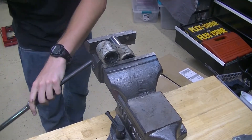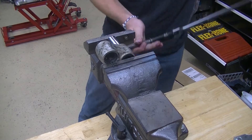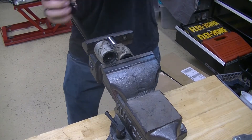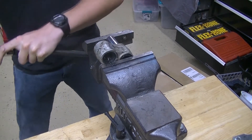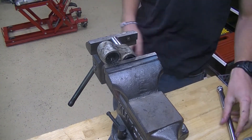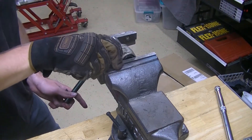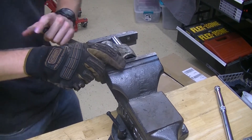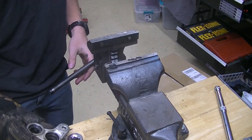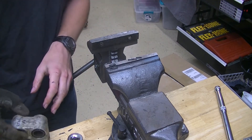There it goes. Now just imagine how difficult that would have been to get out if you were just beating on it with a hammer. So now we're pushing the bearing into the other bearing and using it as even more leverage to get everything to come free. We're going to add a little bit more heat to make sure that the other bearing is free and ready to move. We've achieved the next stage of bearing removal — I'm wearing a glove, it's not heat-rated but it gives me a little bit of protection. Better than nothing. And there go all the needles.